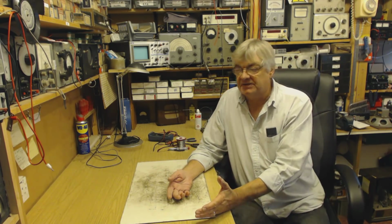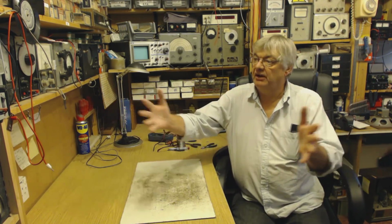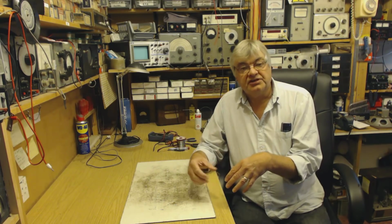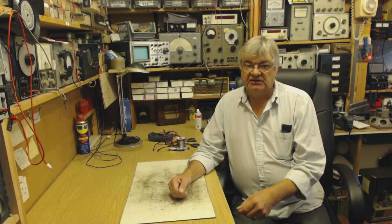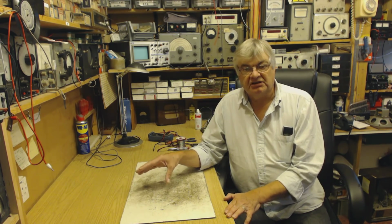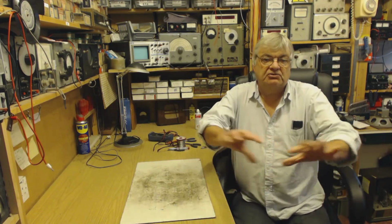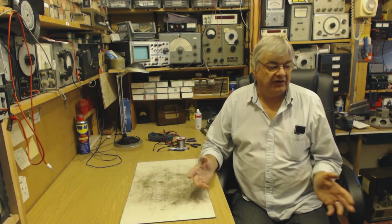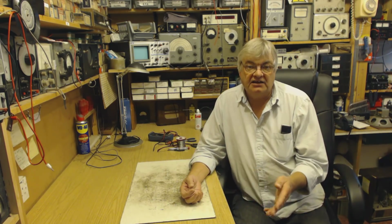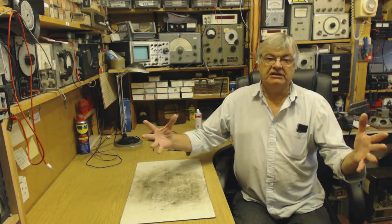So every socket you plug anything into is full of interference. Now, I've said that your house wiring can act as an aerial and pick up radio stations, causing the modulation hum. It can also radiate interference. The interference from a noisy carbon brush motor like a vacuum cleaner goes down the mains into all the house wiring in the loft and wherever, and that is transmitted. The house wiring again is acting like an aerial, but this time not for receiving, for transmitting.